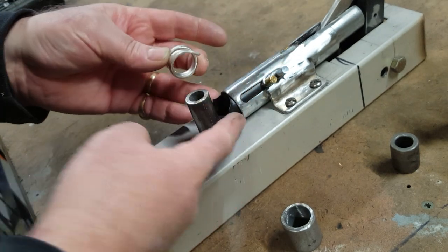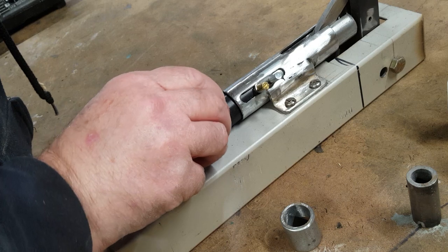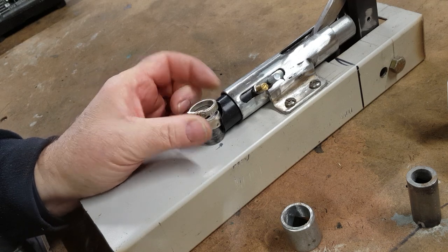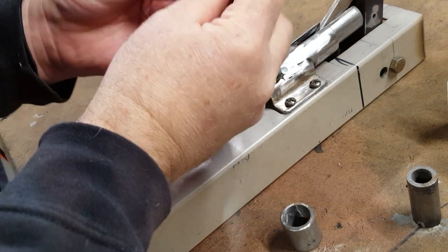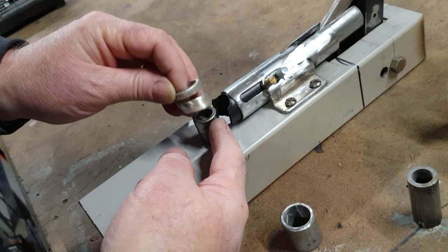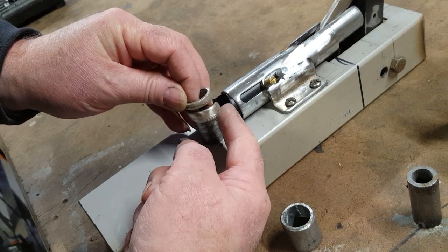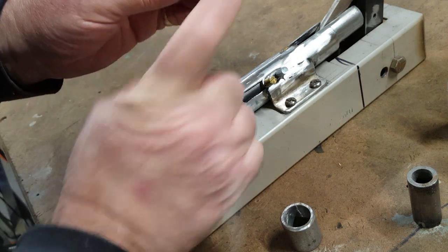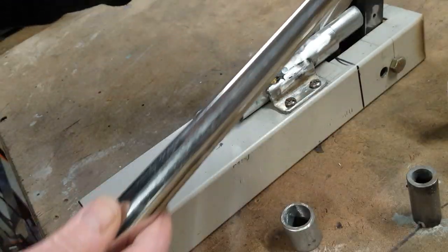That would be the hardest part of this ring to bend. We're probably not going to get it on this set of forms - we may on the next. Just try it, let's see if we can get a little bit of bend in it. I'm just picking it up on the tail of the jaw form here. It started to turn in a little tiny bit. You've got to be careful though - when you put it on, let's call it the platen - if you tilt it you're going to bend it out or in. Remember you're trying to twist the ring in, not out.